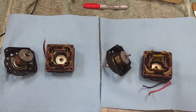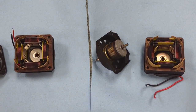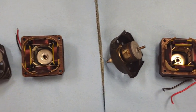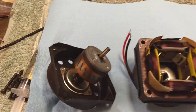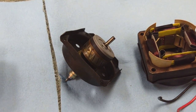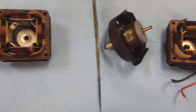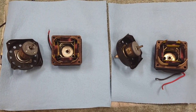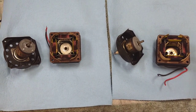At first glance it really doesn't look any different. The windings on both are about the same color. There's no excess burning or charring of anything, and smell-wise they seem okay. Same size rotor and same size magnet on it. Nothing stands out as being strange. They both look the same, both have the same spin-down time roughly, bearings are just as clean. However, the defective one never comes up to speed and makes that horrible noise.